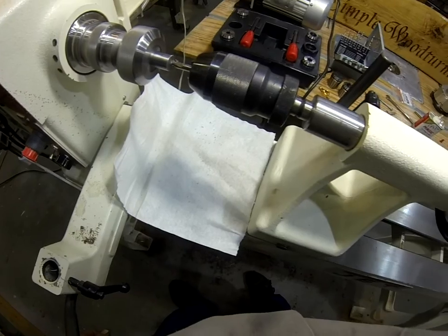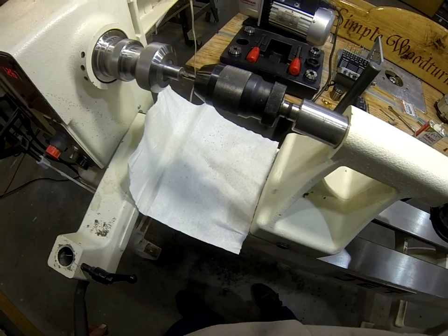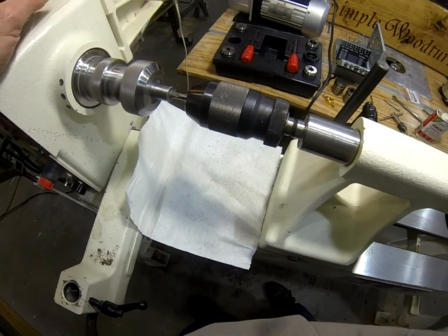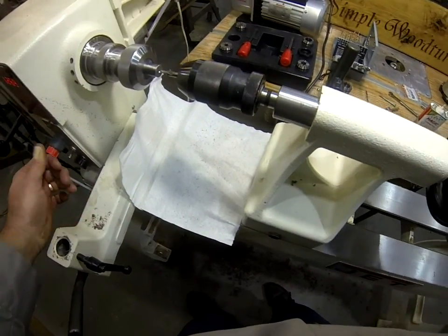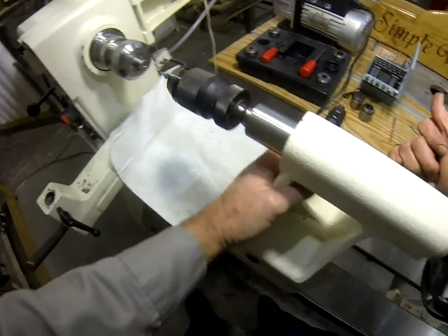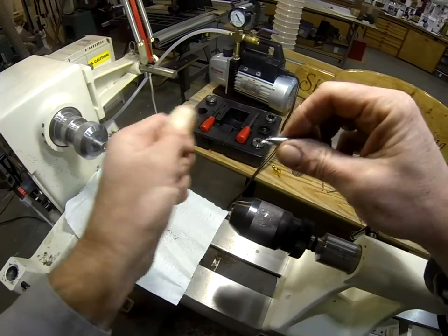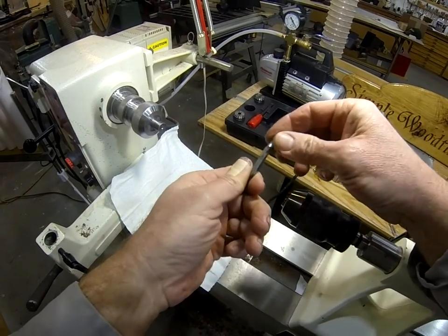Working pretty nice. This is a very basic metal lathe operation — machinists will think it's funny but a lot of woodturners haven't been exposed to this. We got a spot drill and a little countersink, pretty much right in the middle. That nice stiff center drill works out great. You can get these anywhere — eBay, Enco, Wholesale Tool.